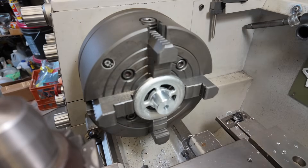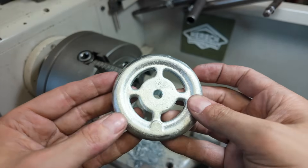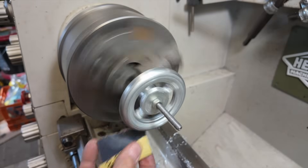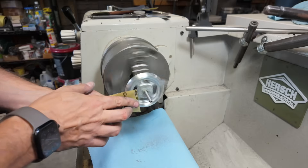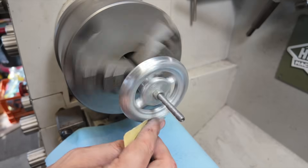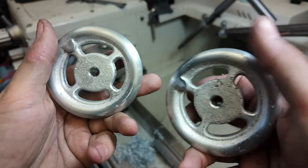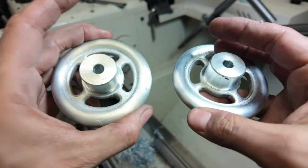After the initial machining, things are starting to look pretty good. I was looking at the hand wheels on my South Bend and decided that before stepping away from the lathe, I wanted to attack the outer ring with a couple of different grits of sandpaper. This is the part you're going to be grabbing with your hands pretty often, so I wanted to give it a nice smooth texture. After a little sanding, it just looks and feels much better than that raw sand texture you get from the casting.